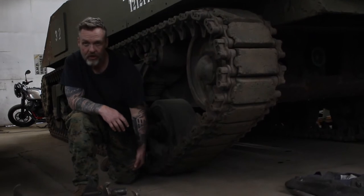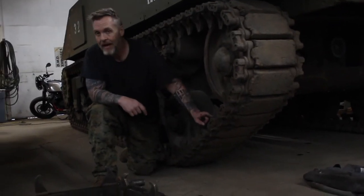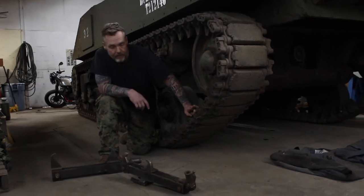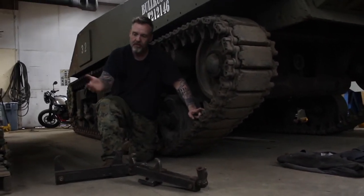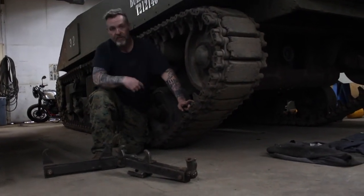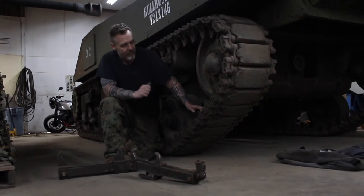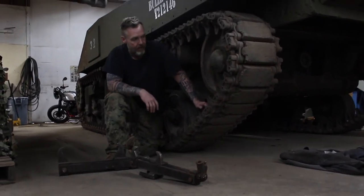And as you loosen the track jacks, the tracks will open up. These being live tracks, they have quite a bit of tension to them, because with the rubber bushings, they're kind of formed in the shape they are as they go around the tank. So they have a little bit of recoil action when you open them.